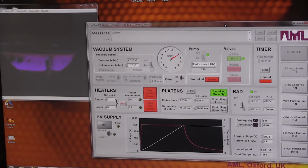So if you have full wafers, what's the point? It is not fully compact. So you have to have cavities in a circle, and then you do this bonding in vacuum. Then you reflow the glass to fill those. And then you just heat it after, yeah, you put it in a furnace or something. Because I have some wafers. I have one wafer.